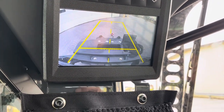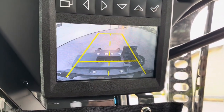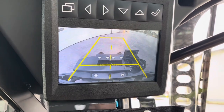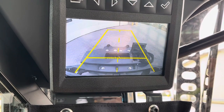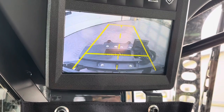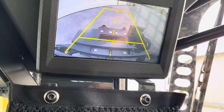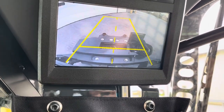You can actually do it without the skid steer running, which is pretty phenomenal as well. And as you can see on the rear view camera on the lower right hand side of that screen, there is also a spot to hook in a hand lever — one that you can use by hand. Plug it in and it has enough to get you all the way to where you need to hook back in, so you can do it that way as well. It's just easier to get the cable in and out of the winch.